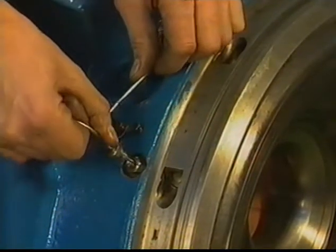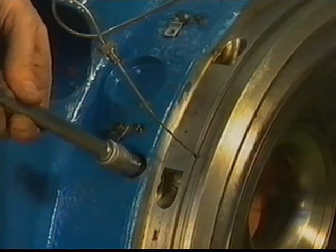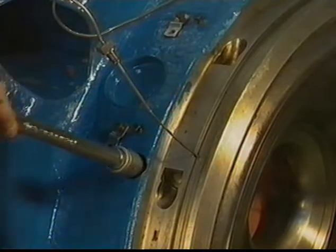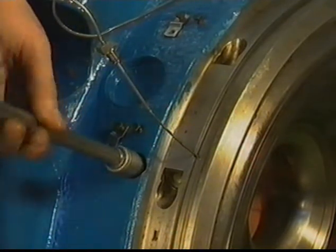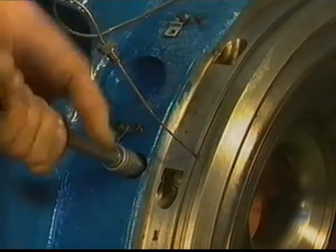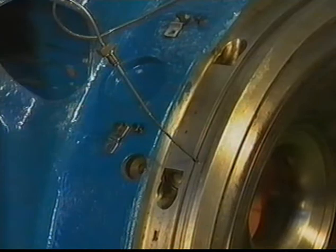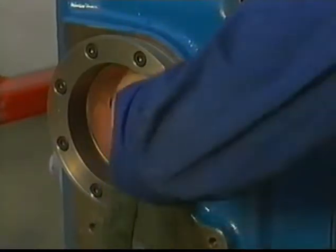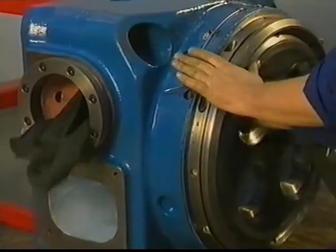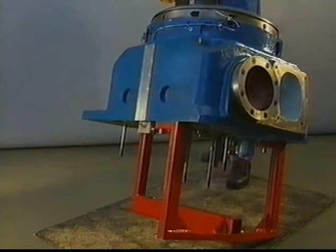In order to prevent damaging the exhaust valve temperature sensor and pocket, remove the sensors before removal of the valve seats. Turn the cylinder head upside down. This can be done with the lifting tool still in place. A special tilting block can be ordered to handle the cylinder head in an easier way.